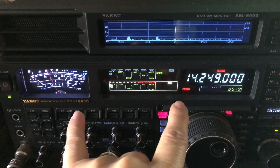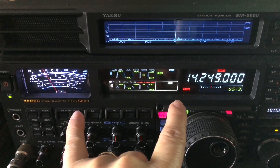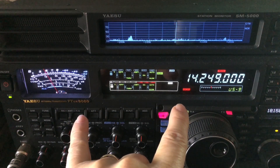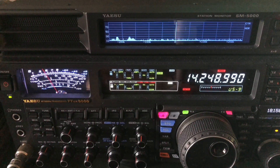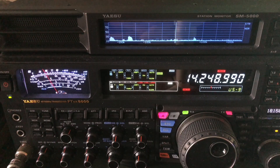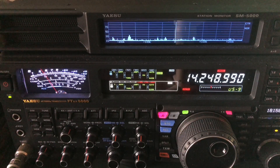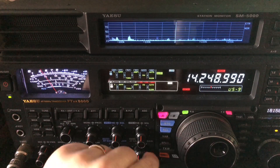I think that older radios - I know from the era of the nineties - had really good analog noise blankers that just worked. Some of the newer radios where they do the noise blanker in the DSP are not so good, actually. This one I was surprised - I was a little concerned about how good the noise blanker would work, but it's not too bad. My old Yaesu FT920 and FT890 probably have better noise blankers, but this one's knocking it out.